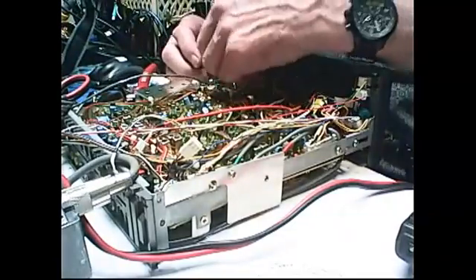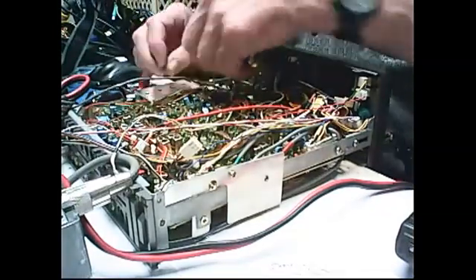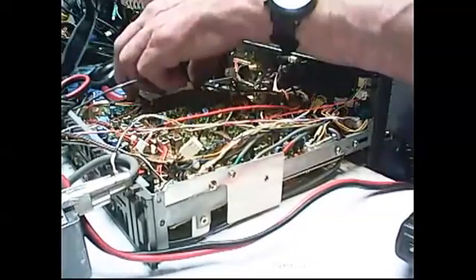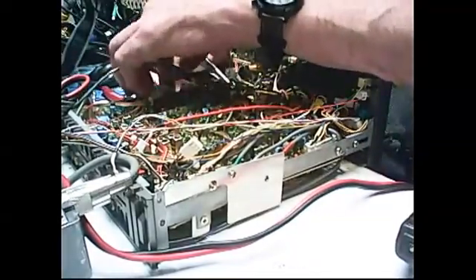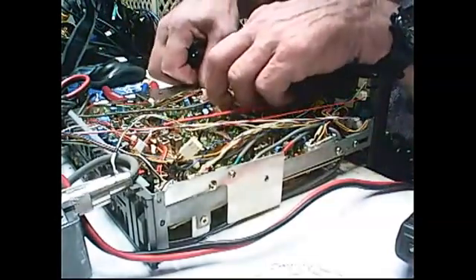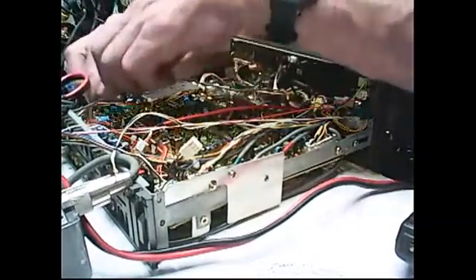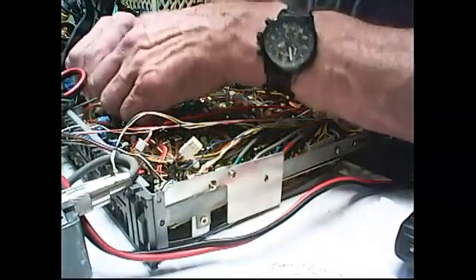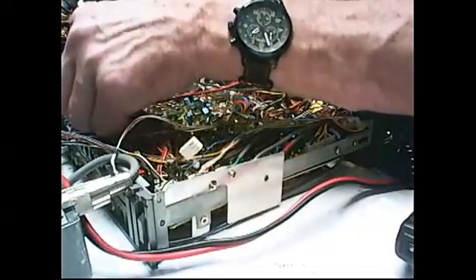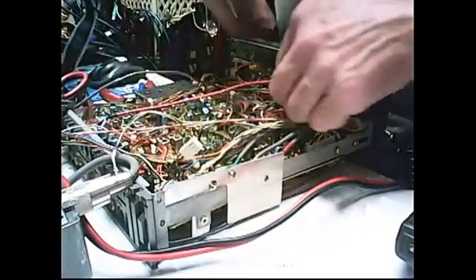This is 19; this goes here. When you do this, you've got to be careful — put all of the plugs back in the right spots. They're not actually marked, and the plugs aren't numbered the same as the jacks, of course. So you've got to go look it up on the schematic. That's the only place. It doesn't give you a layout anywhere as to where everything goes, except on the schematics, and it does number them there — thank goodness.